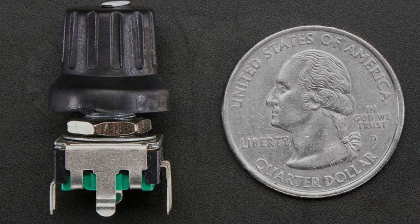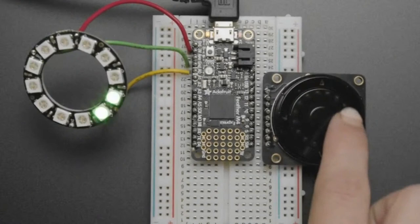There's also other kinds of rotary encoders, like this iPod click type. Basically, whenever you want something to rotate all the way around, especially if you also want a button, I really like rotary encoders. They're one of my favorite user interface types. I think potentiometers are cool, but rotary encoders can have a very elegant feel to them. If you have an oscilloscope, there's tons of rotary encoders on it. Medical equipment, cars, stereo systems, whatever. Anything that has adjustments on it tends to have a rotary encoder.